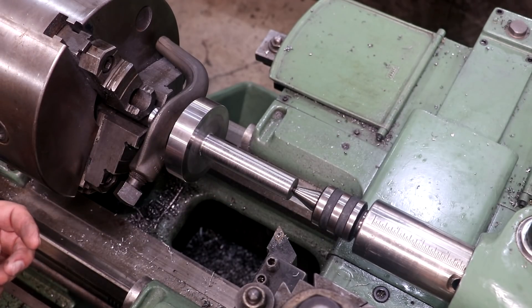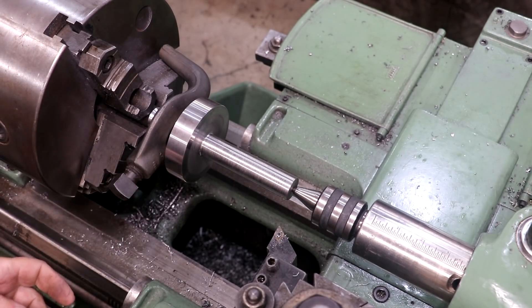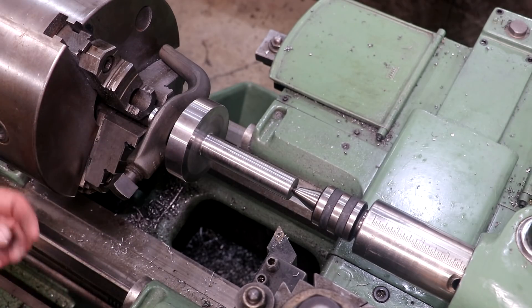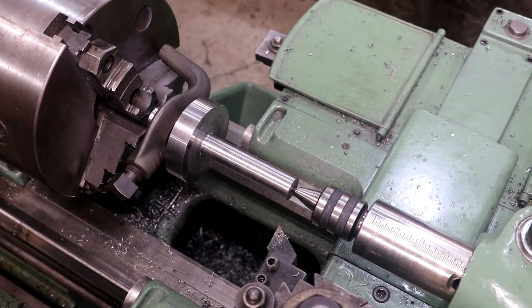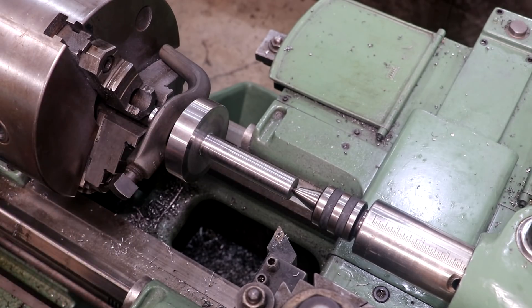It's really a nice setup when you're working on something where you've got to work on both ends of the shaft and you don't want to have to worry about putting in a four-jaw chuck. Back in the old days, they didn't have a lot of chucks on machines and a lot of turning work was done between centers. Another nice thing about turning between centers is in a factory setting, they could have one machine set up to do one operation, take the part off, put it on another machine running between centers, and it would match up perfectly every time. It was used a lot in production work. We don't use between centers as much today, but sometimes in a project like this it still makes sense.